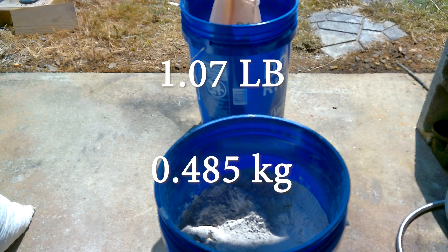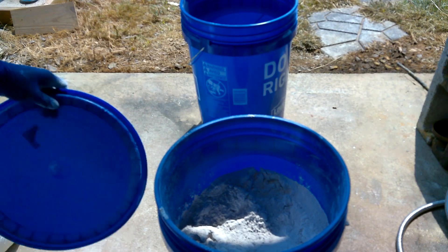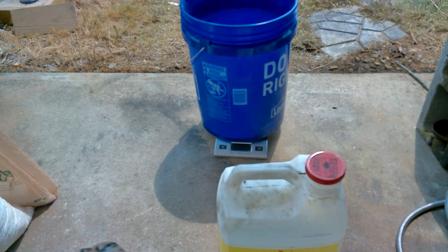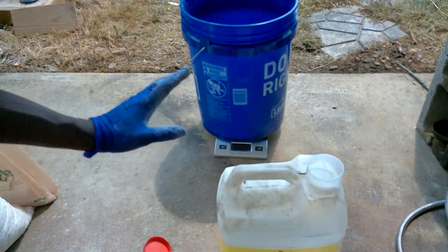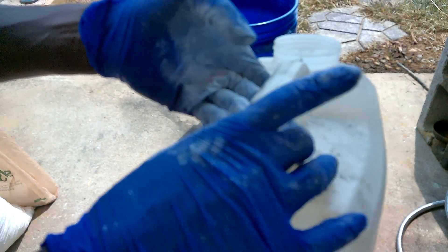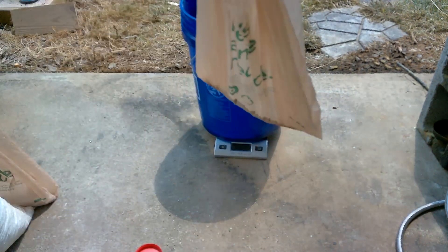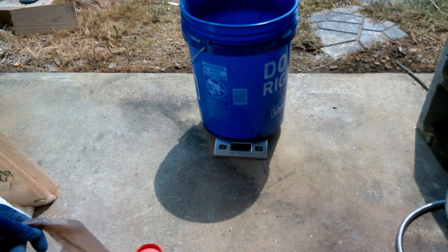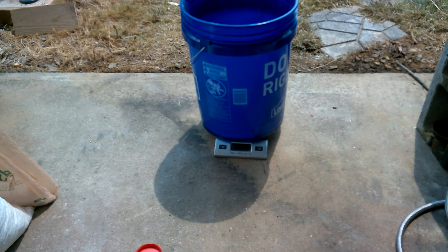1.07 — I'm on fire! So that much lime. There's one last catalyst I like to add that I didn't add in my last video, and that is kitty litter clay. This adsorbs to some contaminants as well. I don't know exactly what it does, but in the past when I've added it, I've always had positive benefits like higher oil yields. We're going to add 0.07 pounds of clay. By the way, for all the new people — the carbon allows plastic to absorb microwaves, because plastic on its own will not break down in a microwave environment. That's why you can put plastic covers in your microwave and they won't break down and turn into fuel, because you don't have a catalyst in there.